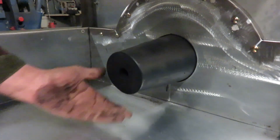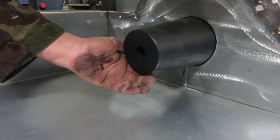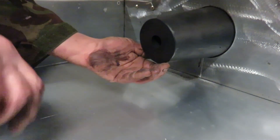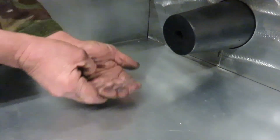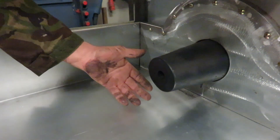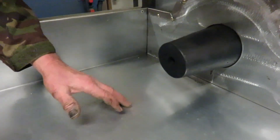You've got your air coming straight into it. Any impurities go down through your fire, and will build up here in a shape just like my hand. When you're actually using it, you can get an ash tray under it, and you can gradually hook it out. You can leave your fire intact, so you don't lose any time making horseshoes, or if you're doing iron work, or whatever. That's the beauty of this — you keep a good clean fire all the time.